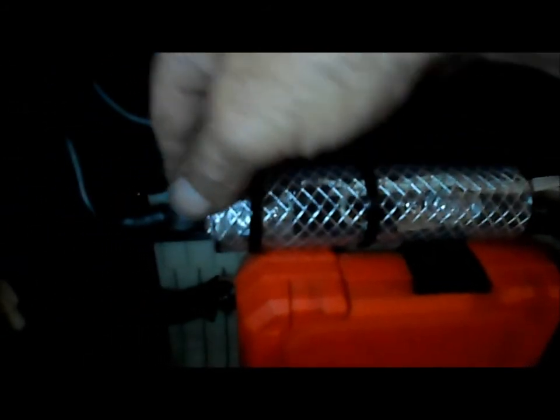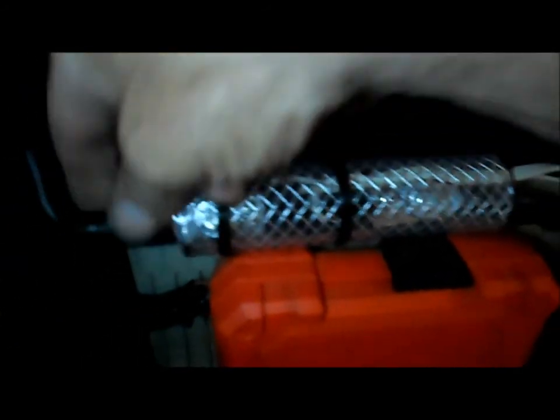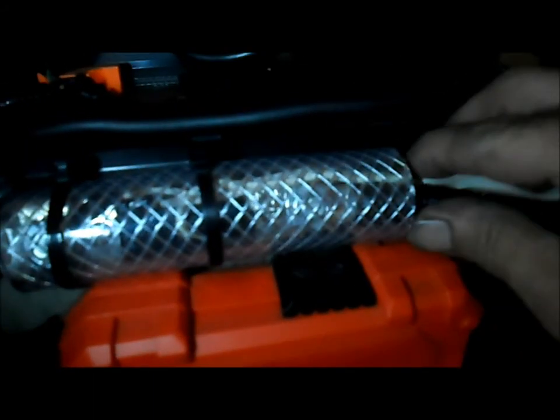One other thing I wanted to check was this shunt that we installed for the meter. There we go, that's better. It's only a 100 amp shunt, and we was hitting way over 100 amps a few times. But I see no discoloration. Don't seem like it got warm nowhere. I felt it several times on both ends. No heat whatsoever.